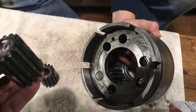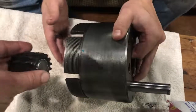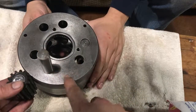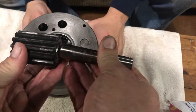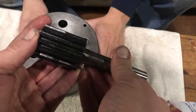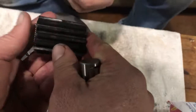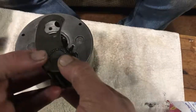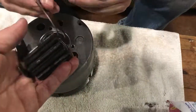There's a total of three long gears and three short gears. So if all goes well, when we place this in here like this and push the new shaft down, the new shaft comes along and pushes the old dummy shaft out. As the new shaft slides in there, it's also going to sit in these thrust pads — in theory, on both ends.